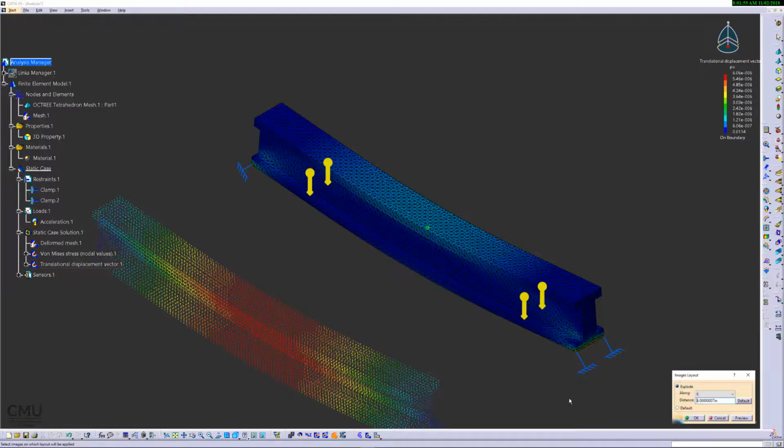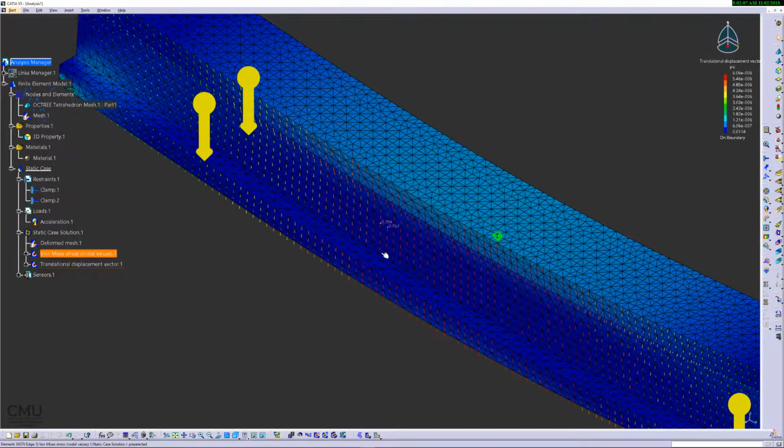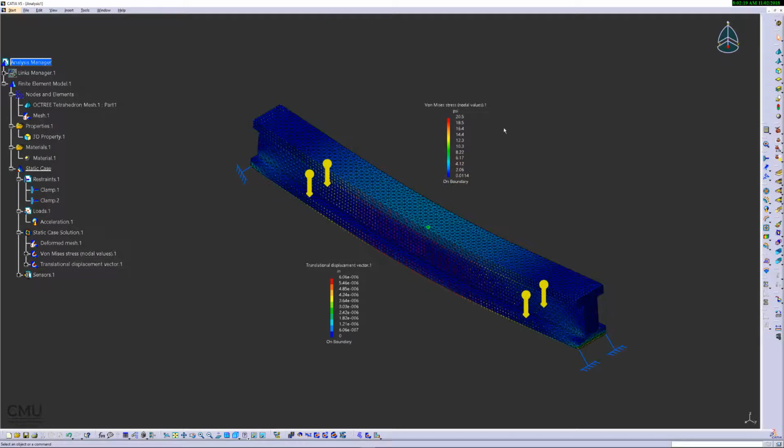But okay, one way you can try is no layout, so it actually shows the amount of deformation and at the same time the stress distribution. Once it's done, you can click and move so that you can see both. Click and move. So you see that it's only 20 psi, so almost nothing, and almost nothing, about millionths of deformation is happening. Obviously, if it's a long, long piece, it's going to be a different story, right? Because it's getting more weight with only very little support, the middle will have more deformation built up, causing stress at the top.